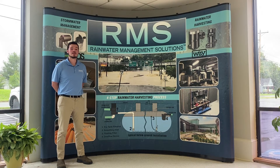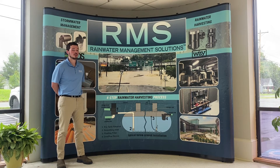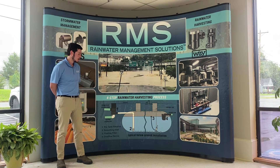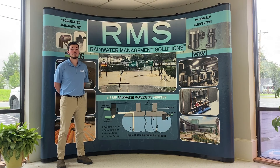That sums up the four-step rainwater harvesting process. When using a pre-tank filter, a smoothing inlet, a floating filter intake, and an overflow device, you will be ensuring the highest possible quality water inside your tank. When these steps are properly applied, you will not have to change your post-tank filters as often and you should never have to clean your tank. Give us a call today to learn how you can start saving water. Thank you.